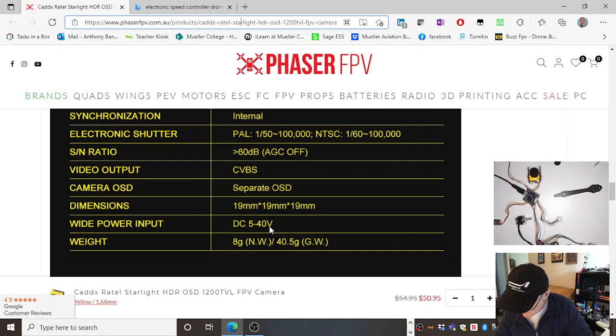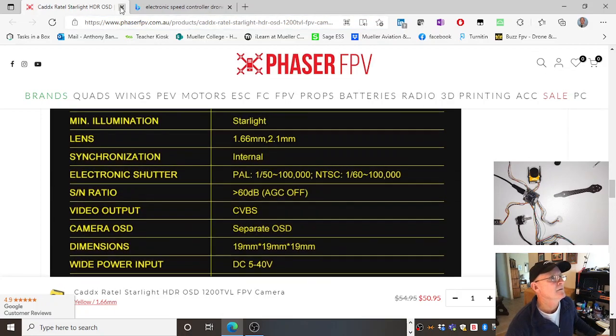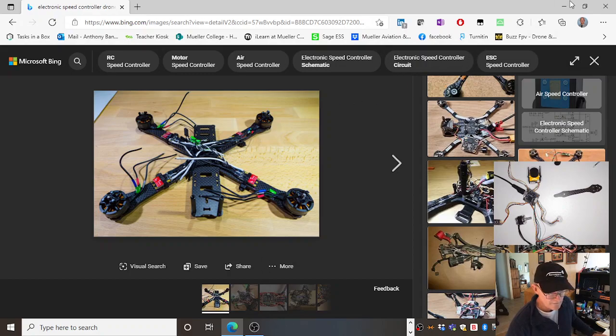Camera 1. So VBAT. What does VBAT mean? Voltage coming out of your battery compared to other voltage sources coming off here, which could be just 5 volt, and they'll be labeled. But V battery, if I'm putting a 3-cell lithium polymer battery on there, which is 11.1 volts, 3 times my 3.7 volts per cell, that's 11.1 volts coming out along that power there. And if that camera can't handle that, this one can, but if it can't, that's there. From speed controls we've done, that's all good.